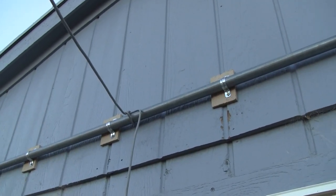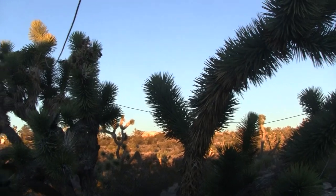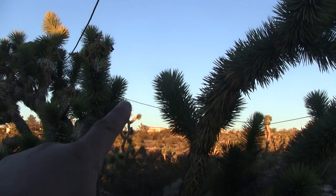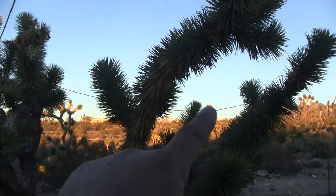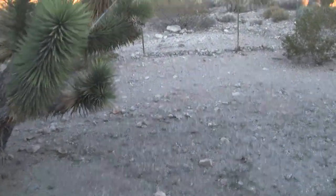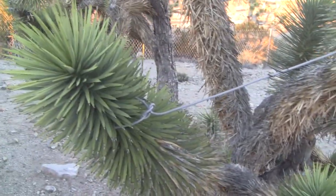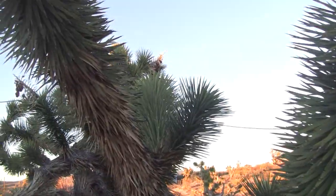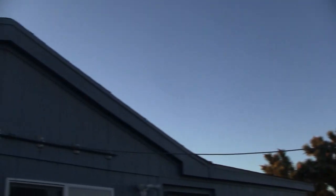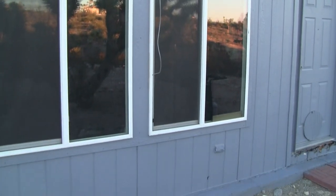It's strain relieved on a pole. Yeah, I know it's rigged, but you know what? It works. It goes here and then across over here and across over here — it's just laid in the tree. That's all I did. I'm gonna call it a random wire antenna. What length it is, I won't have a clue. Don't even care. Having a piece of wire outside the house is way better than having those telescoping things on the inside.